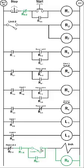And what we have to do is remember that event. We have to remember that this was closed at some point in time, and to do that, we use a holding circuit. No problem. So we're holding on to that signal to keep this energized, and the reason we need to keep that energized is so that the cylinder continues to extend. Once it extends, it hits limit 2, and that becomes closed.